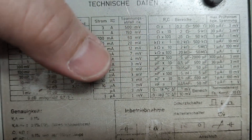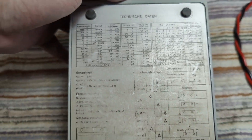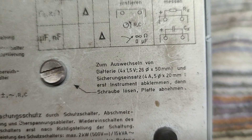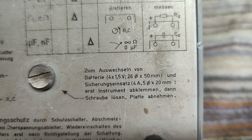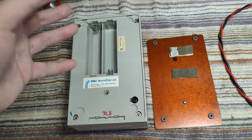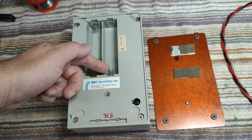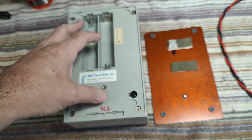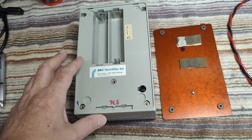Obviously you need an amplifier to make the meter read anything. It says something about the batteries here — we've got four, one-and-a-half volt C-size cells. Since this uses amplified readings for everything, you're going to use the batteries faster. This is why you have four really big cells in here to contain the energy for a month of usage.